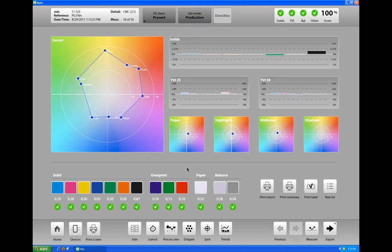We also have a new technology called ChromaTrack, which you can see on our website, that tells an operator how best to adjust their color for the optimal color match on press. To summarize, we've tried to make everything available from one view, complete understanding of your 7-color process with both densitometric attributes, gray balance, and color delta E indicated at the bottom.